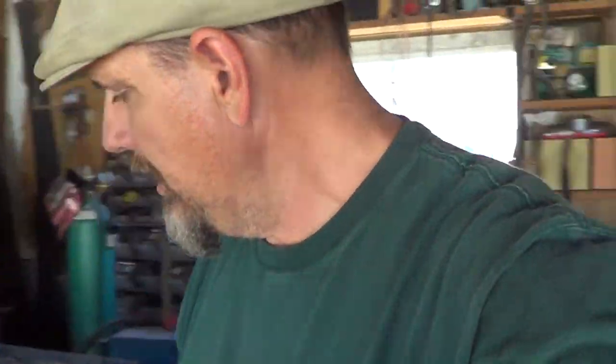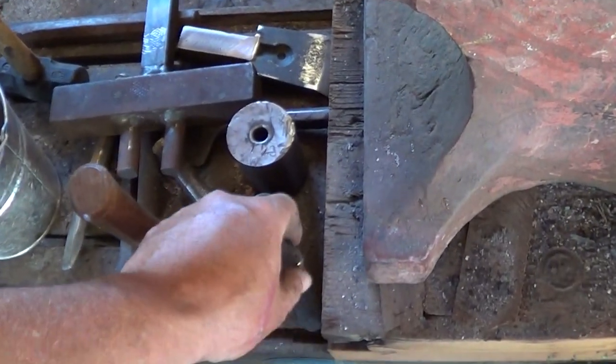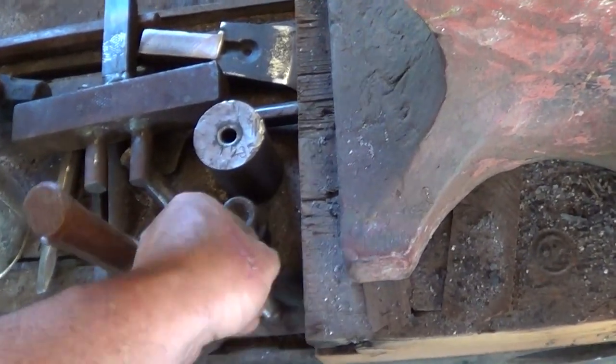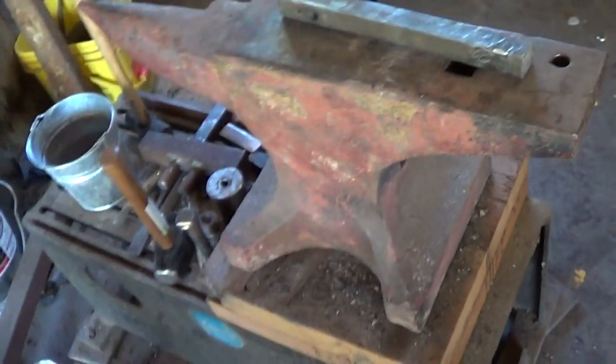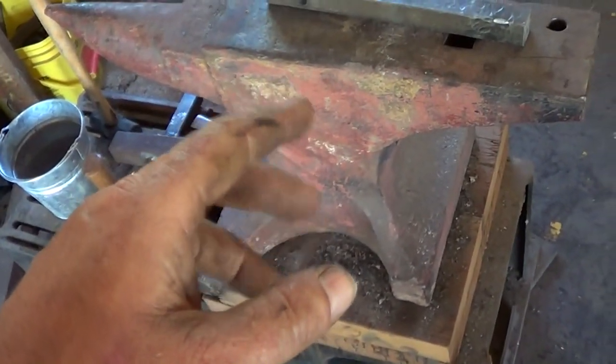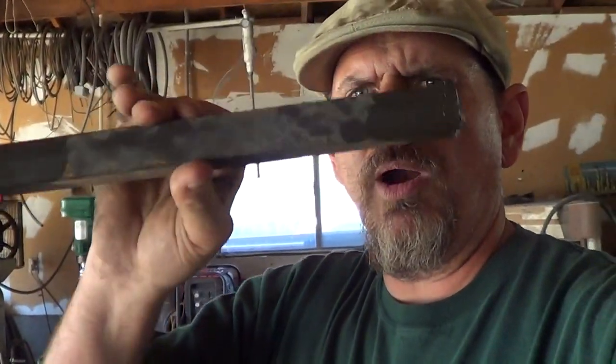So the last several days, which I haven't really been keeping too much track of, I designed the door handle and spec'd it out for rivets. Anyway, the last few days I've been building tooling. I still have one more piece of tooling I have to build, and that's going to happen right now. And then we're going to be building the handles. Here's a drawing right there. It uses some 1-inch bar for the grip, and then some half by one flat bar for the brackets, and it all gets riveted together and then riveted to the door. And that's what we've been doing.